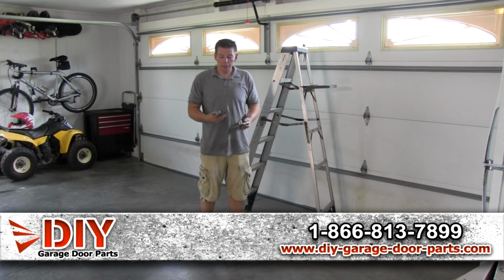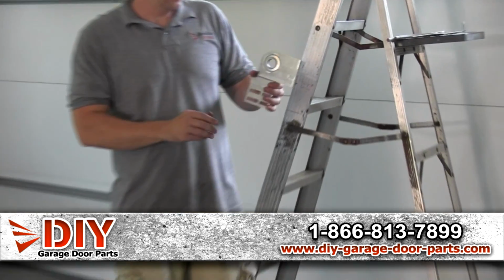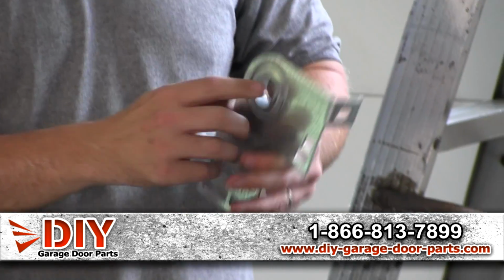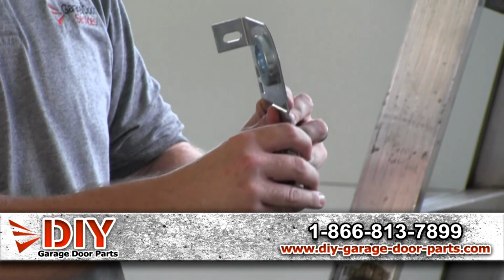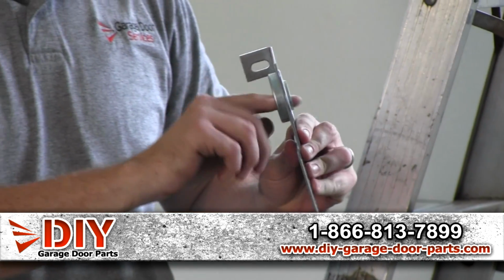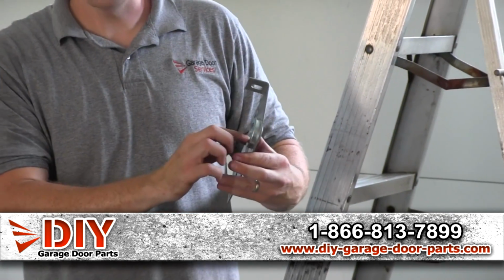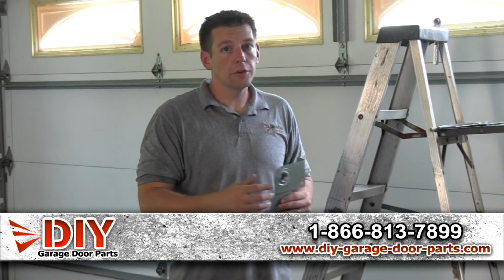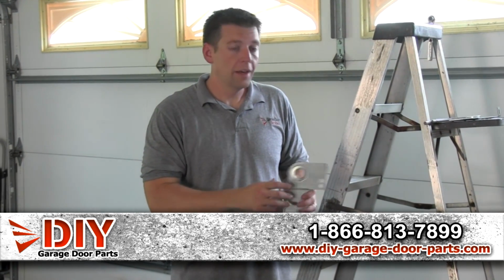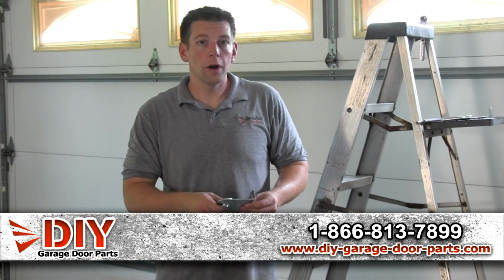to change your end bearing plates. A lot of times the bearings can wear out just over time. Sometimes the installer that installed your door had them cocked over to the left or the right, and that will prematurely wear them out. A lot of times you can see black steel dust on your track or around here, and it can start to cut into your torsion shaft. So it's a good idea to change these out. These make a big difference on how smooth your door operates too.